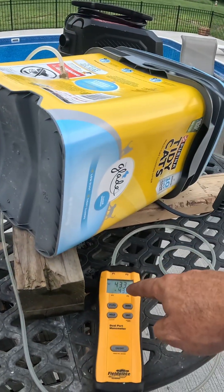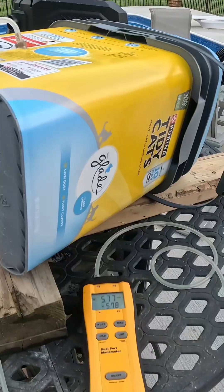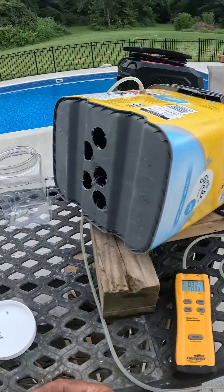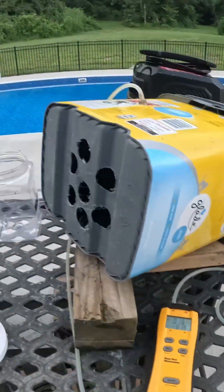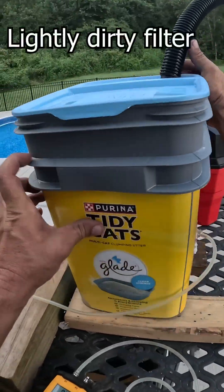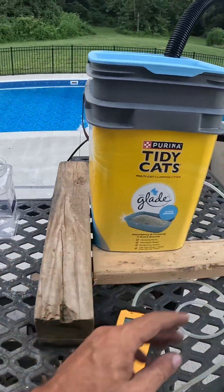We got 0.43 inches of water column. Now we have 0.58, 0.83 — so as we add more return air in we lower the static pressure to 0.16. We're going to leave it there, so if they have a dirty filter that would be right on par with what we would see in a real world application.